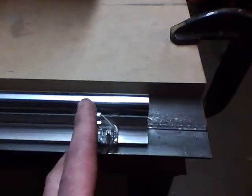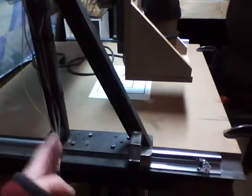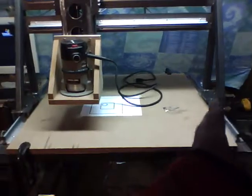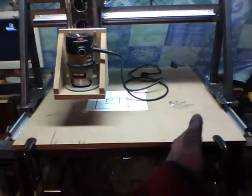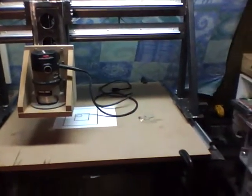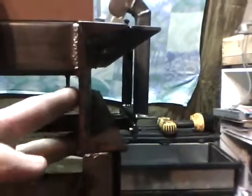My bearing block stops there, leaving about an inch and a half of glide left. In essence, I can get a ten-inch spread on my bearing blocks and still maintain 18 inches of travel. With 18 inches of total travel, I figure maybe a 20-inch deep table — so that's ten inches on the bearing blocks, five inches hanging out of each end, which would be 50%/25%/25%, which seems like a pretty reasonable arrangement. And the more I stare at this, it looks as if I can literally just flip the table upside down — these glides would turn sideways and mount there with the rails there, and the table would fit in between them. I just flipped the whole darn thing over.